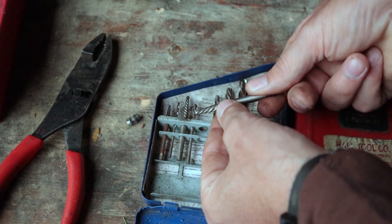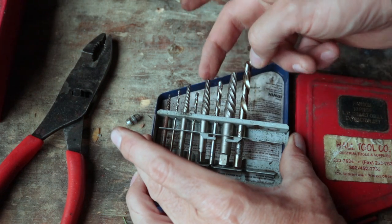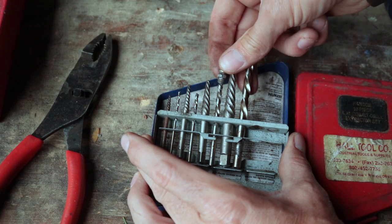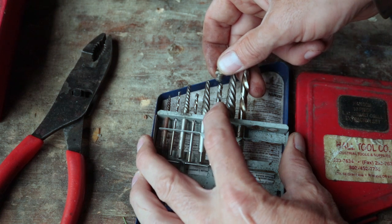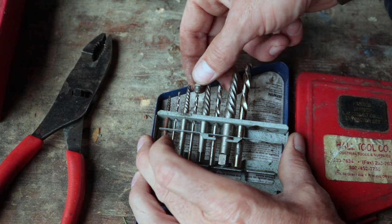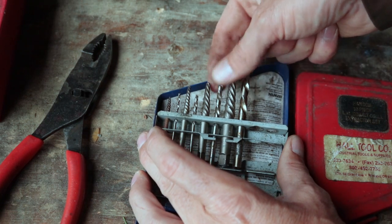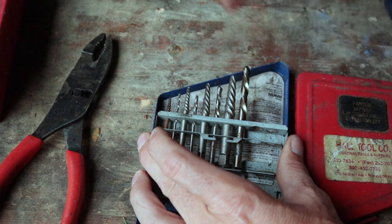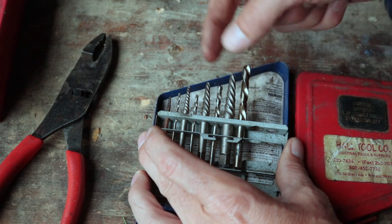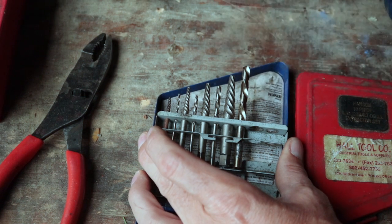What you get in these extractors is a drill bit, plus a tool my granddad used to call an 'easy out.' It has really sharp teeth and you turn it counterclockwise, which backs the broken thread out — and they work really, really well. Right next to them is the corresponding drill bit. When sizing these, take your new fitting and make sure you don't use a drill bit bigger than the threads, because once you drill through there, you'll drill out all the threads and there'll be nothing to screw into anymore.